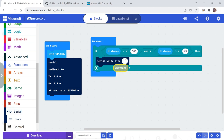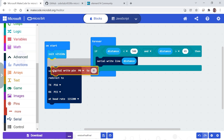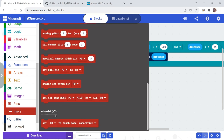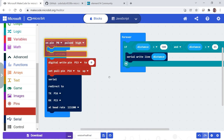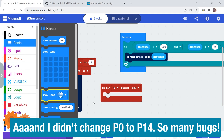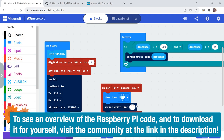That will send the number off to the Raspberry Pi to control the lights. I've also added another button to the setup — it's connected to pins 13 and 14, with 13 acting as ground. We pull pin 14 up, so when it pulses low, that means someone's pressed the button. Remember the distance sensor never shows zero, so if I send zero I know that's the button being pressed. Let's download that and get outside.